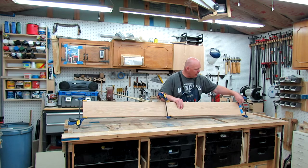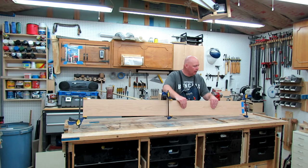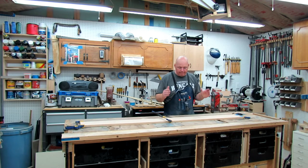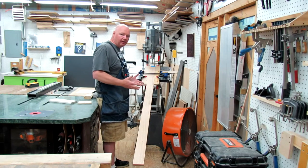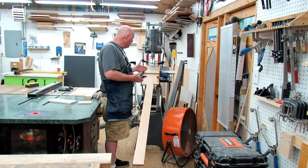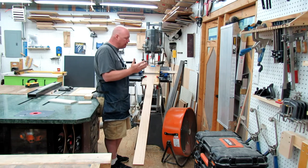A tip I've got: I like to use painter's tape to mark my projects. This way you're not writing on the wood and having to sand it out later. You definitely want to mark the tops because you don't want to invert it and make a mistake — I want the grain to run the same direction. I've got my Shopsmith set up to drill the angled holes. They're 70 degrees from 90, so the table is set at 70 degrees. Some people may call that 20 degrees depending on your perspective, but since I'm going from 90 back, I'm calling it 70.